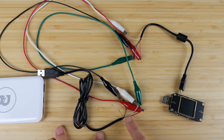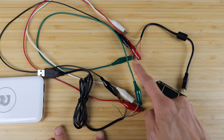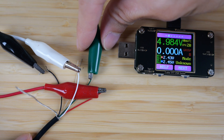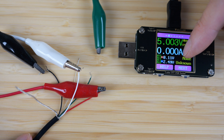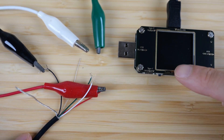A micro USB cable actually has five conductors and one shield in it. When you're doing the resistance measurement, you'll only be checking the continuity of the black and the red wire. What about the two data wires? On the second page, it required me to connect the ID line to ground in order to see D-plus and D-minus. Now I'm going to disconnect one of the data lines — if it's not connected, it's going to show something very low, like 0.1 volts. If I disconnect the other data line, the D-minus line, it's also going to show 0.1 volts.